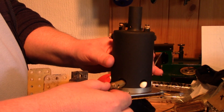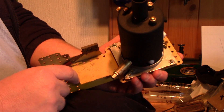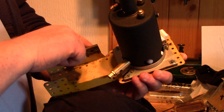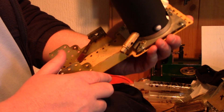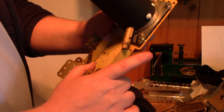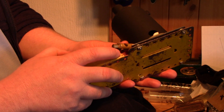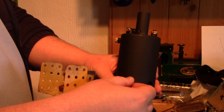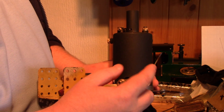There you can see the burner — that's extra. It's quite a large burner. It's not clamped in place yet and I've decided to save space in-board here. There'll be pipe work back on and the bolt that holds the cylinder onto the face there, just outside the main frame at the corner. I can still get at the screw hole there for Meccano use, but what I can't get at very easily is the little bolt that holds the jet in place on the burner. The idea is that once you undo the clamp there's enough play to move it around, lift it up, and get a small screwdriver or penknife blade in there.